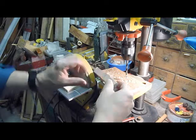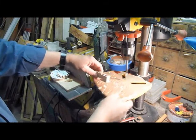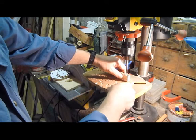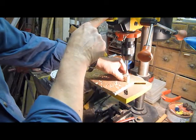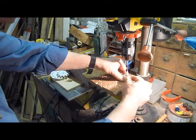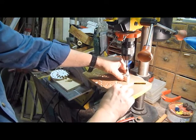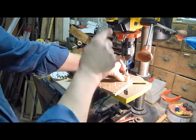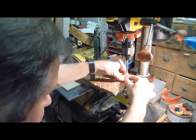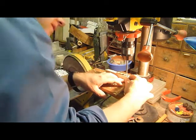In order to position my pipe so that I can drill the hole, I'm going to start the drill spinning. If I start the drill spinning, it's easy to see the position of the drill. If I stop it, because of the cuts in the drill, it's really difficult to see — looking one way or the other — whether it's centred. Whereas if I now place the drill above a nice piece of bare board and then spin the bit, the optical illusion of having a complete tube makes it easy to check. That looks like it's nice and centred all round.